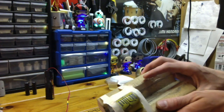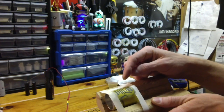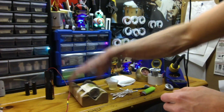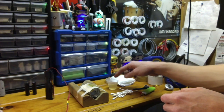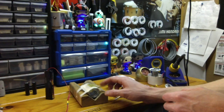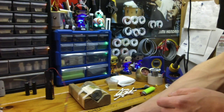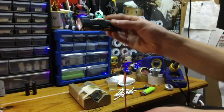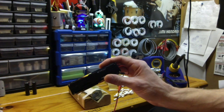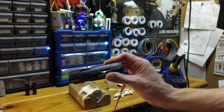You can see here. Well, you probably can't see here because the camera's not great, but I've already started this, given it some time working on it. But I'll show you how to do it. So other than the vinegar, the salt mixed together, some Q-tips, the pattern all taped off, I just taped it to this block of wood to hold it, so it's not sliding around on me. Then the power source. I've seen people do it with 6 volts, but you want at least 9, 12 volts. This is like what, 15?